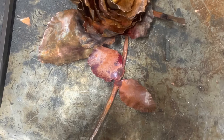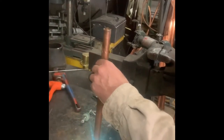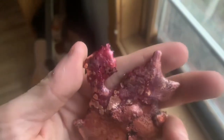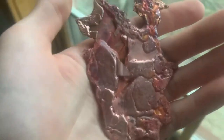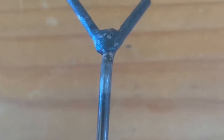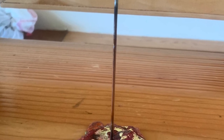However, because my rose had a slight curve to the stem, this gave Donnie and I the idea to create a stand to hold it up. We decided to make our base using all the scrap I had made when creating the rose, and fusing it all together using the blowtorch, creating a copper nugget. Because the nugget was melted at such extreme temperatures, it caused the copper to form all sorts of different shades and colors, like this one you see here. Donnie and I also experimented with fusing some brass in there, adding some gold to the mix as well. After it had cooled, I drilled a hole into the center of the nugget to stick a wire through it. Afterward, we took a small wire and brazed another little piece onto the top to form a Y shape. Lastly, we brazed a wire to the nugget to keep them from separating, and then sprayed it with some clear coat.